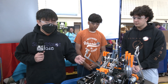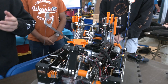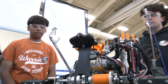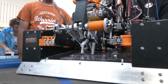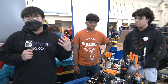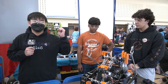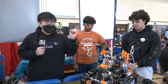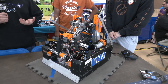The second thing I want to talk about is the vision system. We don't actually have a light on the camera itself. To mitigate lighting changes for detecting samples and specimens on the ground, we always start autonomous with the tile in front of us. We take a color sample of that tile and use it to tune the lighting, giving us an accurate representation of the lighting in that specific area. This allows us to dynamically change how we detect samples and work in different lighting scenarios without much difficulty.